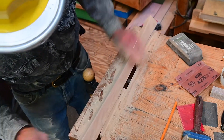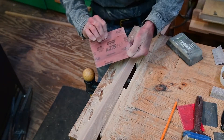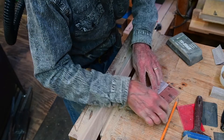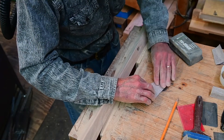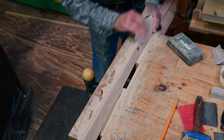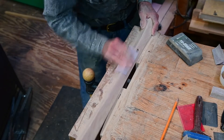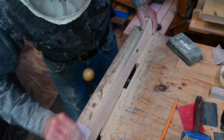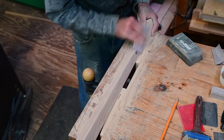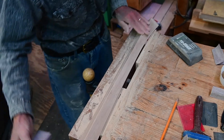I'm working on the toe at the foot. I'm going to go to 320 and finish it off — this is just to polish it into the other surfaces that are already sanded to 320. A lot of times I'll put a towel down over the vise once I've gotten to this stage. Once you're close to finish, you want to protect your sanded surfaces.